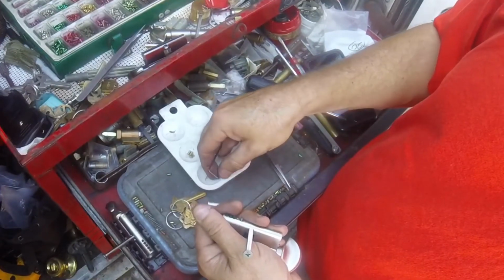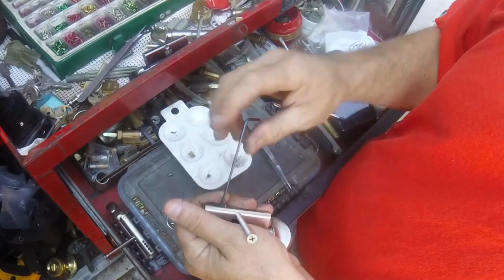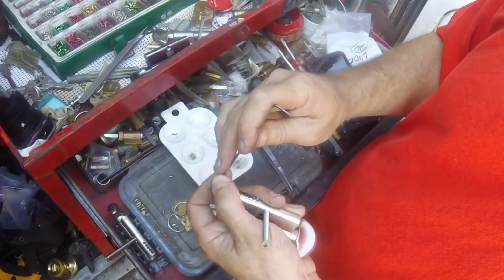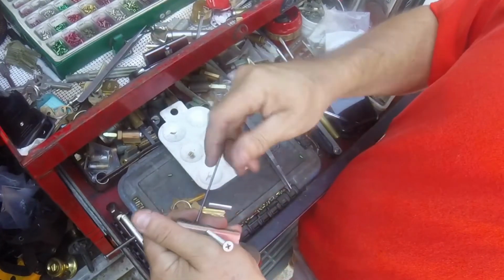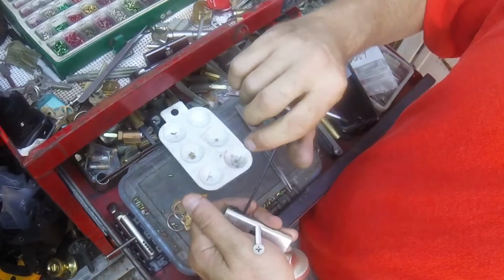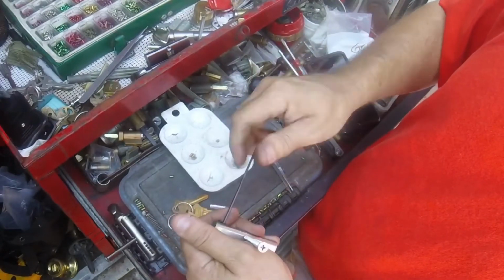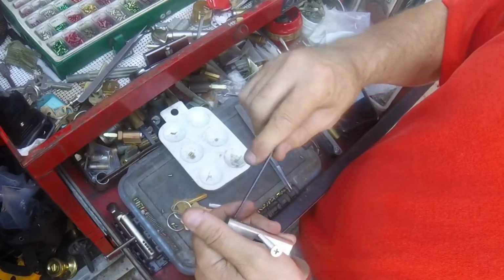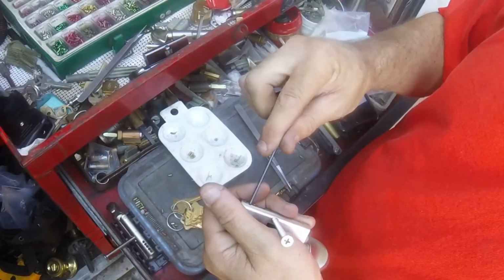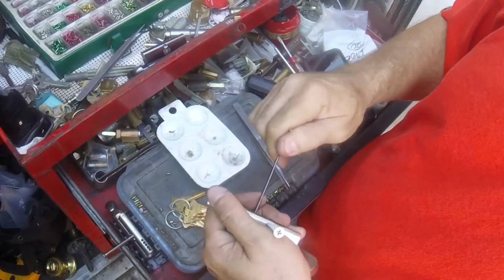On this same job, they have outfitted many floors, and I have found that the latch retractor on the inside of the cylindrical body is made out of super crap aluminum or metal, and they break easily. So I foresee many, many problems with that. He said he took the outside lever off, assuming by hitting the pin and pulling it off, and he was able to stick something down in there and turn it, and it turns, but it's not retracting the latch. So my first thought was to grab my under the door tool and try to turn the lever handle. But if the hub's broken, the interior lever handle is not going to do a thing either.